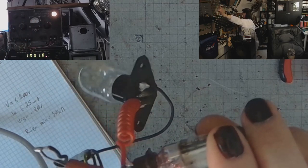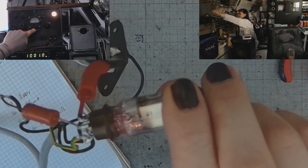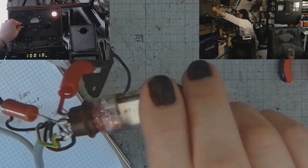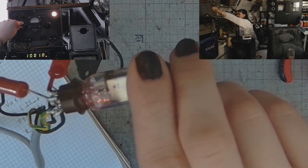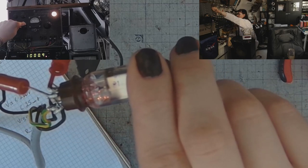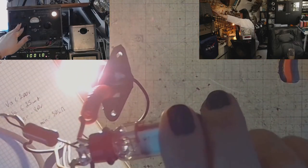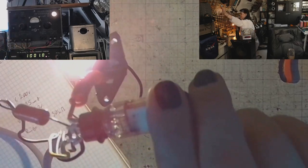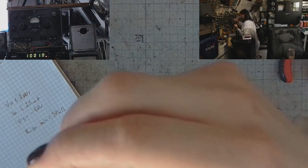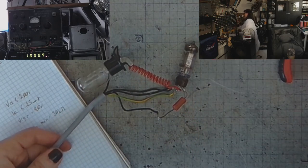Plate voltage to 250. Negative grid voltage. Let's go up and up. Measuring it. Minus 20. Still not. And I had to reach zero for the Thyratron to ignite. So that concludes the TG3-0.1/1.3. Watch your eyes again. The light is coming back.